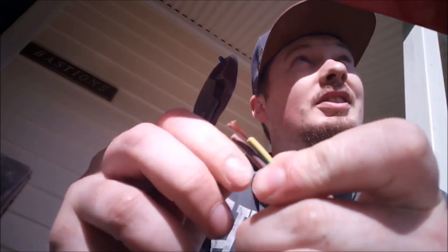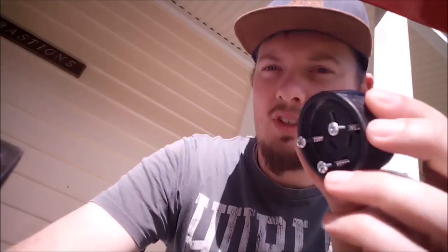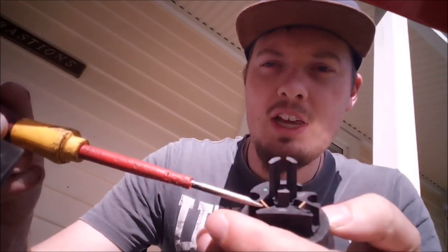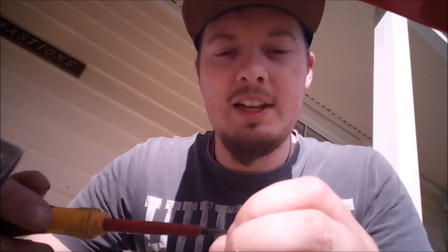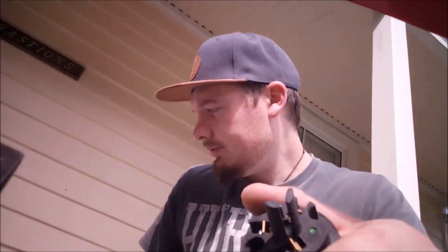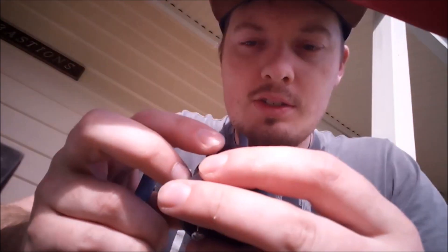On the strip length gauge there's a wee end bit that shows you how much copper should be showing — it's on the smaller line, so it's only about a centimeter or less. Then just strip the ends off. Next thing, grab this end here and loosen off these terminations on the clamps. Don't undo the screw completely or it'll fall out and you'll have trouble re-lining them up.